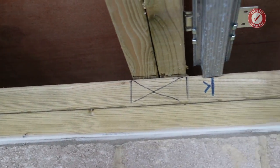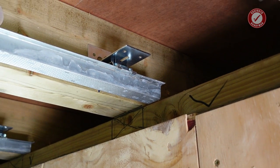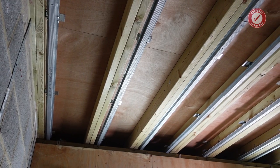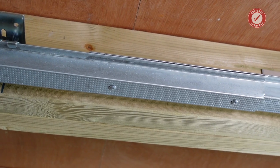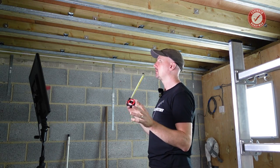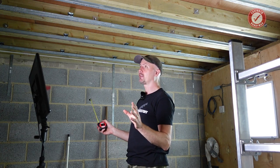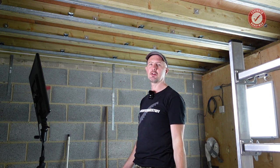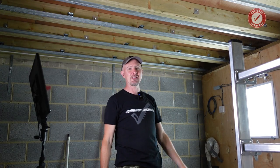That's the first batch of furring bars all installed. It's not fun cutting them — I've got a special blade in my chop saw. Be very careful because shards of metal can easily go in your eyes. I've got a 220mm overlap and I've held them together with a couple of little panhead screws. Next job is the insulation, which is probably the least fun part of the whole project. I'm not going to film it — trying to operate a camera with bits of insulation falling on your face and gloves on is nigh on impossible.